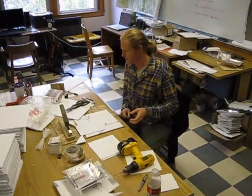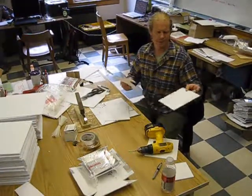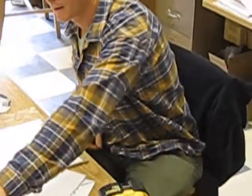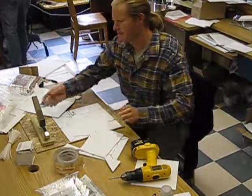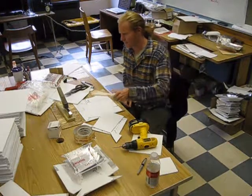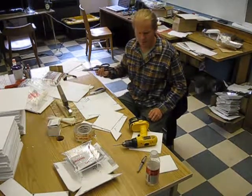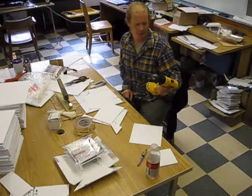The materials you'll need to construct the radiation shield include a couple of templates for rapid production to help you draw the outlines you'll be cutting. You need some kind of aluminum foil tape — this SureTape AF100 is preferred because it's pretty thick. You'll need a heavy duty half-inch stapler for stapling the plastic plates, eight-inch plastic zip ties to secure the plates of the radiation shield together, a utility knife or scissors, and finally a power drill.